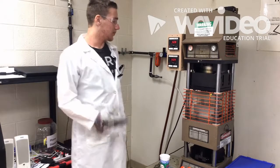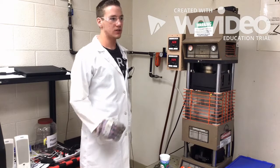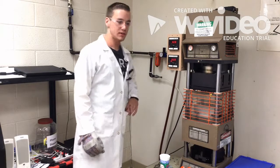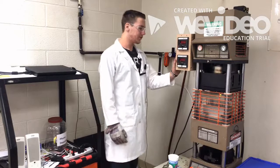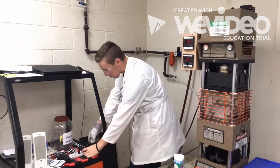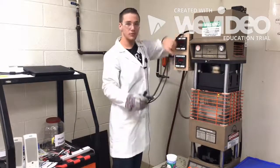To clean up with the machine, you have to keep molding until you get an incomplete sample, and after that, you have to inject a couple more times just to make sure that the barrel is empty. Once you don't get a sample, you go ahead and flip off the switch, turn off the air pressure, unplug the machine, and clean up your surrounding area.